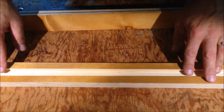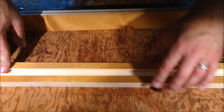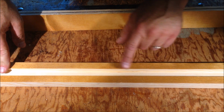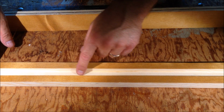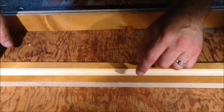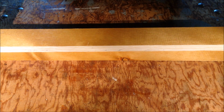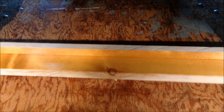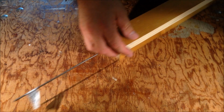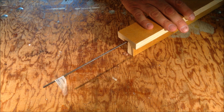I went ahead and made a top for my base using the exact same dimensions as the base, 2 1/4 inches wide by 24 inches long, and I routed a channel up the middle 3/8 of an inch deep by 3/4 of an inch wide. This forms a nice cap on top of my base, and it still allows plenty of motion in the rod.